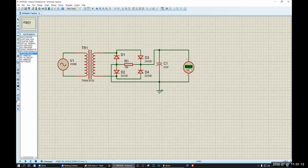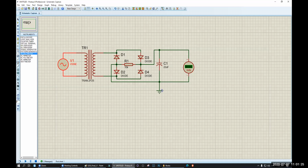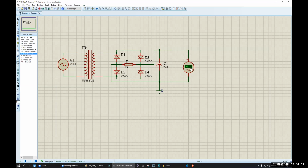Now it is not changing, it is actually a fixed value. 8.2625 is fixed. Now what will happen if my voltage goes down? Because it can go down up to 180. So it becomes 6.55. Still it is more than 5, right? Now if this goes to 240, you are getting 9.11. That's common, because if the input goes up, the voltage here goes up, and the voltage here also goes up. If this goes down, the voltage here goes down, so the final value will go down.